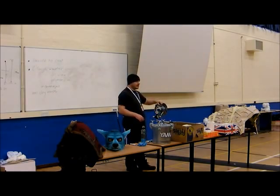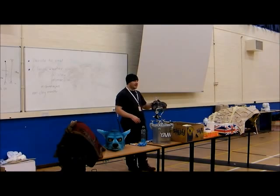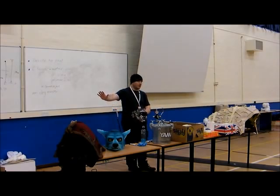do a master cast. Again, that's something very, very useful to do when you do your first pull. Do a very, very thick cast once you know that the mould's good. Don't clean it, don't bore any of the holes out, don't tidy it up, don't paint it. Take it, put it in a box and put it on a shelf.